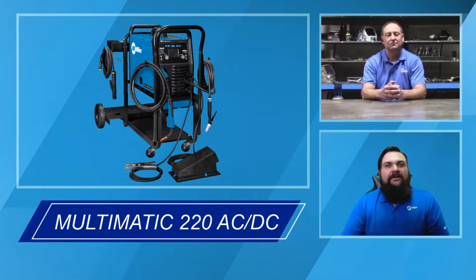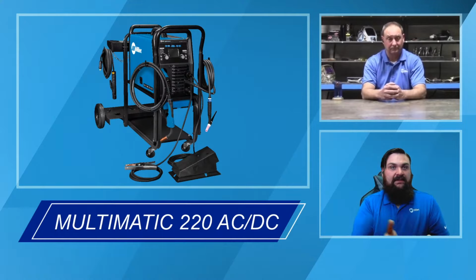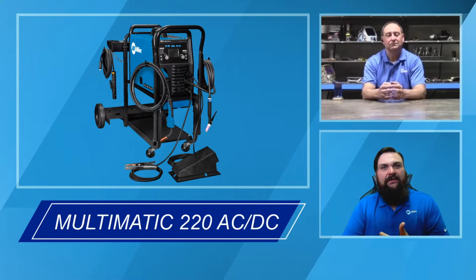Another spot where we see that being extremely helpful is people in their home garage. If you have 120 in your garage today, but you plan to expand to 240 someday, or have the ability to run off a generator if you needed the high end of that machine. Because most of these machines, you're not going to get full output on the 120 side, so we don't want to be misleading there. If you've got a 3/8 machine, you're not going to weld 3/8 on the 115 or 120 side with the MIG side of things. But as soon as you go to that 240 power, you have that higher end machine, so you're not losing that capability either. So you can plan for the future with some of these machines in that way too.